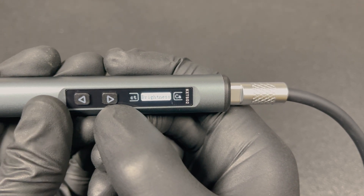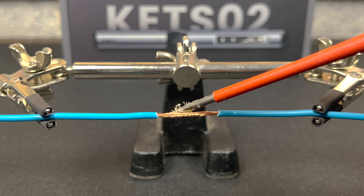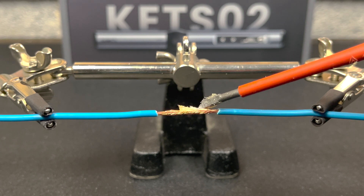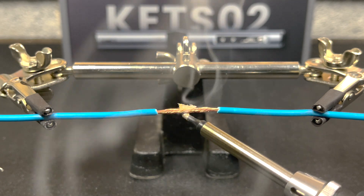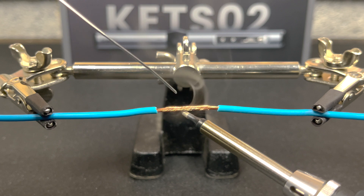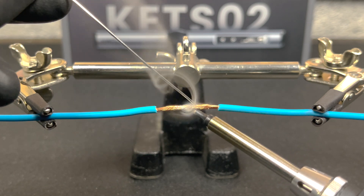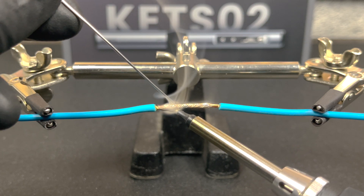Now let's get soldering. For our tests, we're first going to use the soldering iron to connect these wires. Although a lot of solder and wire already contains a small amount of flux, we like to add some extra so it flows better. Put a little bit on the tip first so you can create a heat bridge — makes the material heat up faster. When it is getting all warmed up to temperature, you can start adding the solder to it. First impression: it works pretty damn good. It heats up fast, transfers heat pretty well, and maintains its temperature.